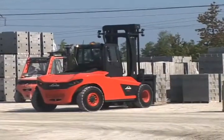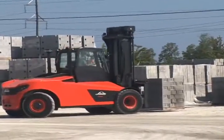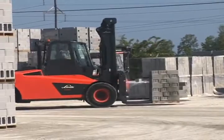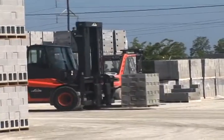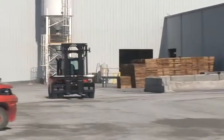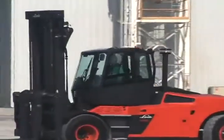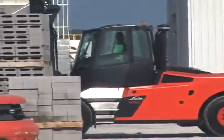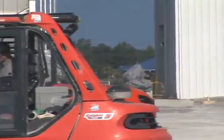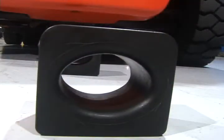No one in the material handling equipment industry manufactures more rugged steering axles than Linde. As a matter of fact, Linde pioneered the concept of shock mounting axles in our industry and introduced the very first shock-mounted steering axles to the industry way back in the 1940s. Today, every single Linde counterbalanced truck utilizes shock-mounted steering axles, relying on front and rear high-density neoprene axle mounting blocks.